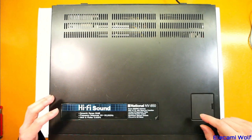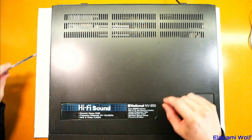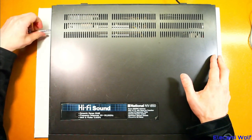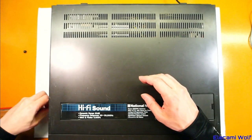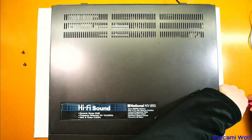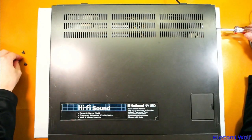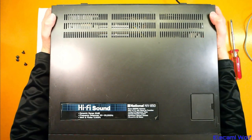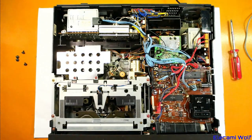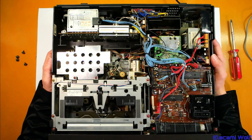We're gonna start with this one — not the one I think works. The other one has stuff rattling around inside it so it's partially dismantled; we'll leave that aside, maybe it'll be good for parts. We'll take the top off of this one and take a look inside. I'm guessing these are about the age that all the capacitors will be going bad, just like the NV870 — one of the next models up. This one is probably a year or so older, so we might find it's just as bad or worse in terms of capacitor leakiness.